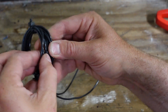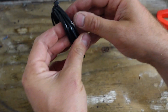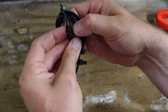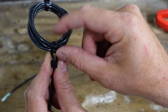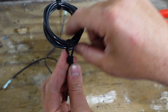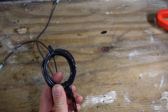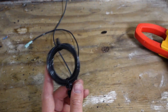Counting the strands, there are 10 on one side and 10 on the other side of the loop. The only discrepancy is right here where I purposefully put this cable tie so that I remember not to put my meter past there — because the wires are tied together and overlap one more time, making 11 strands at that point. Keep that in mind when you're making one: count the strands and make sure they're correct where you're going to measure.